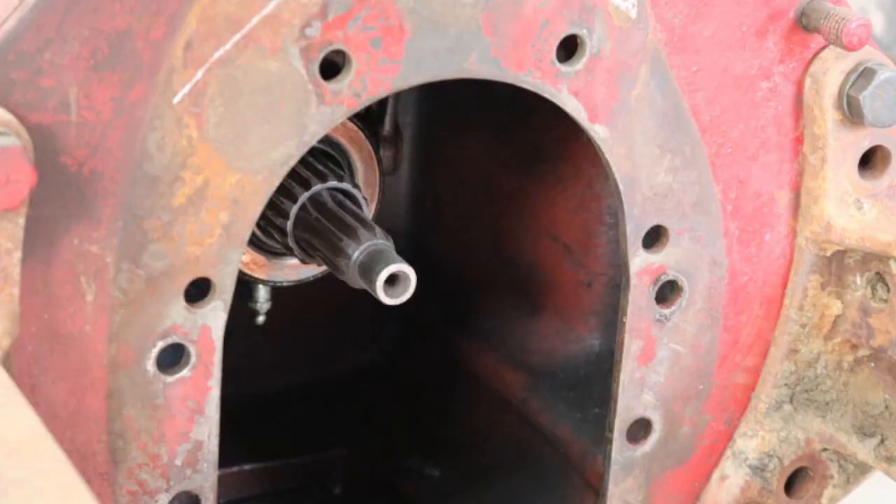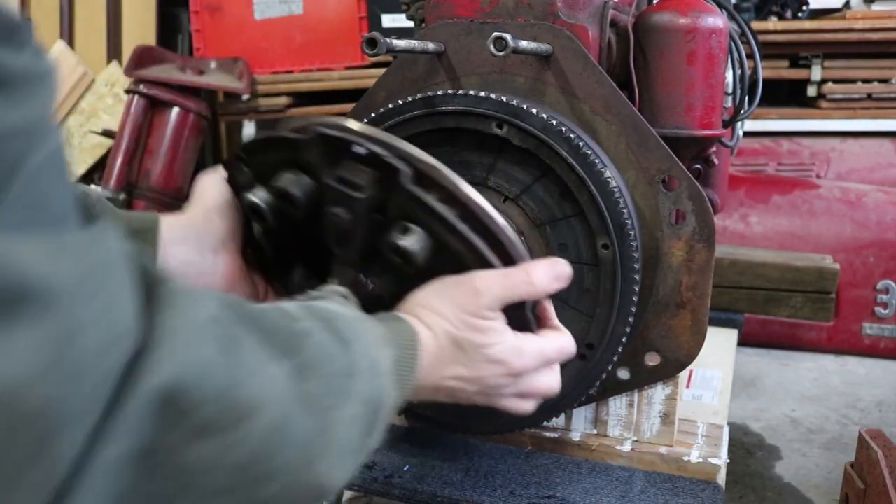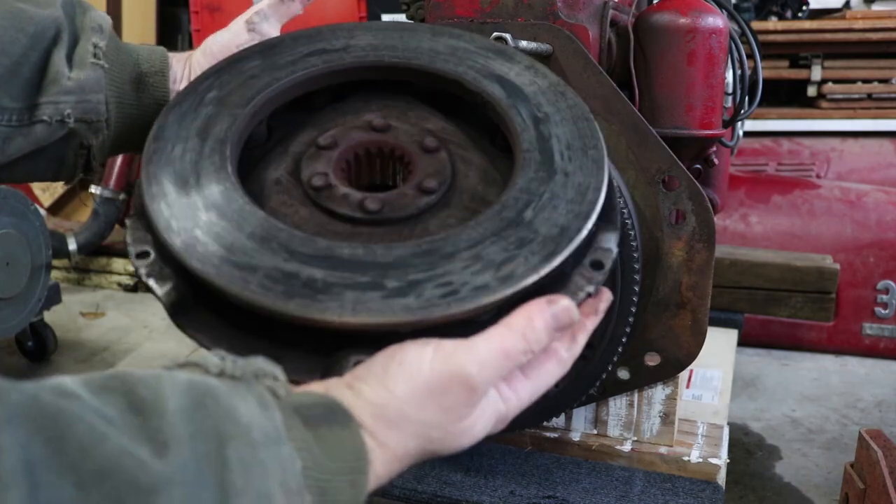That may also be a good spot to add an extra bearing, because with a clutch and flywheel in there I don't think the end bearing on this motor would like supporting all that load. In this case we do need to keep the clutch and flywheel, because the tractor has independent power takeoff powered by a rotating collar connected to the driven shaft in the transmission — and that's always connected to the flywheel. So if we want to decouple the electric motor from the PTO, we'd do that using the clutch.